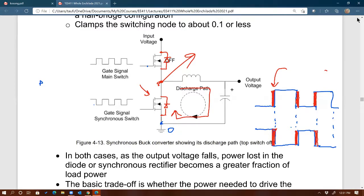And so again, luckily you have that internal diode, but that internal diode is slow. It's a PN type, so it is slow and it takes time. As you already saw in that data sheet, 80 to 110 nanoseconds, so relatively slow. So that could create a problem as well. In two problems, right? We want a fast diode for this dead time, because that's a very short moment of time. We cannot afford to have a slow diode. That's only like 0.5% maybe of duty cycle, so you want a very fast diode to take over the current when both MOSFETs are off. So that's number one problem.